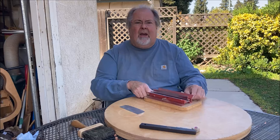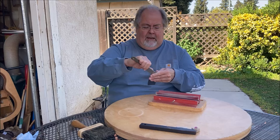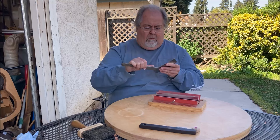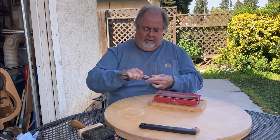So now after I've done that, I just want to make sure there's no burr on that. I'm flattening that edge and feeling it to make sure there's no burr, because we're going to turn the edge after this — so we want that nice and square.